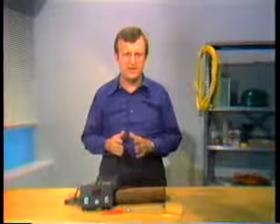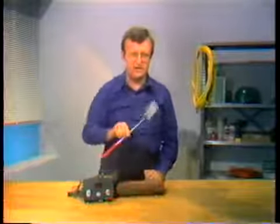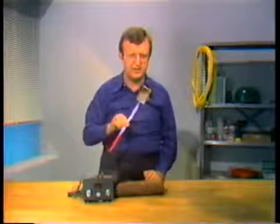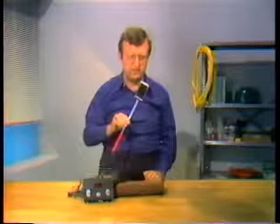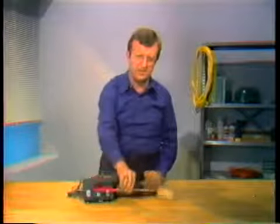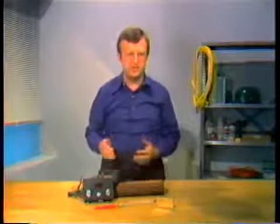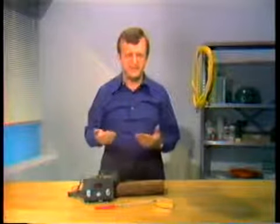Now, this tube spreading method is effective, but it is time-consuming and not practical for periodic inspection. An adequate inspection can be done by looking down the aisles in the superheater bundle, and this long-handled inspection mirror will allow you to look inside the bundles more closely. Spreading the tubes solely for inspection purposes should only be done as a last resort. Other than tube spreading, superheater and reheater inspection uses the same techniques and tools as water wall inspection.